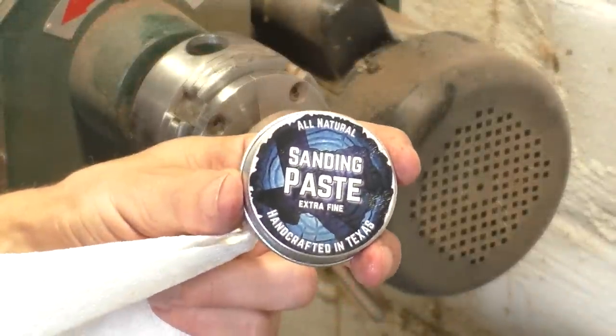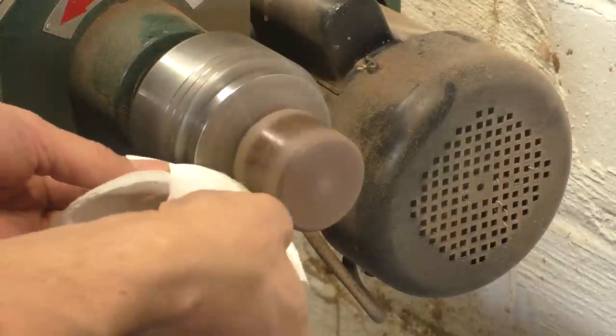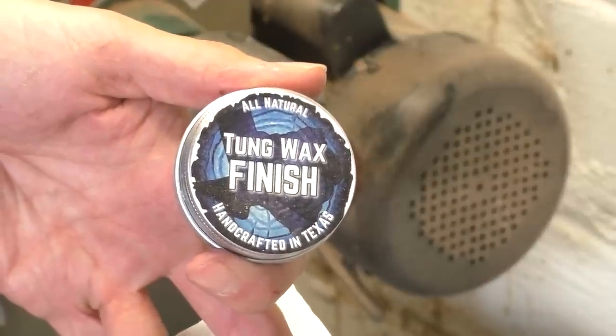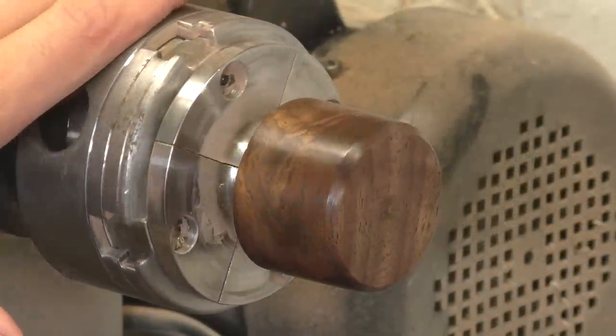I'd like to get a fast finish on these ends, so I'm trying out this sanding paste made by the channel Brad's Workbench. It's just a fine abrasive in paste form, and it lets me quickly take out some of my final sanding scratches and get the surface prepped for a finish. Brad also makes this finishing product he calls tongue wax, which is pure tung oil that's just somehow made into a wax. I smear this goop on, turn on the lathe, crank it up to a high speed, and buff it out. The final finish really does look great, and it was quick. I don't get anything if you buy some of this stuff, but Brad is a buddy of mine, this stuff actually works, and he is hand-making it in his kitchen. I'm sure his wife is delighted about that. I'll leave a link in the description.